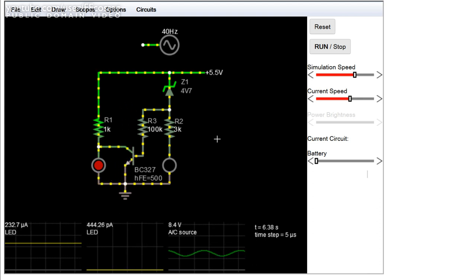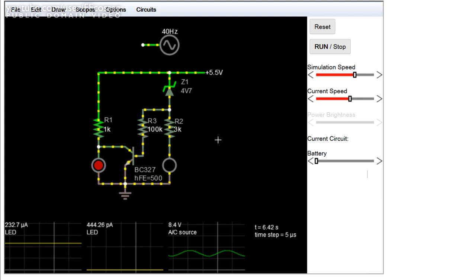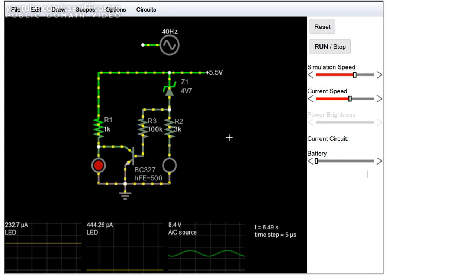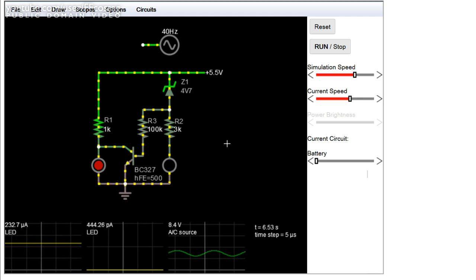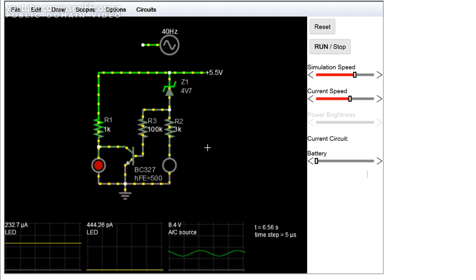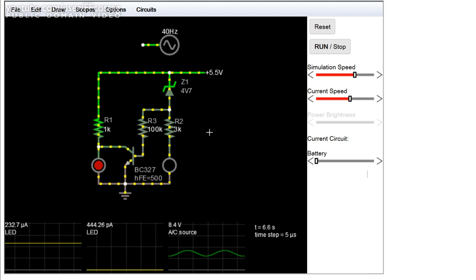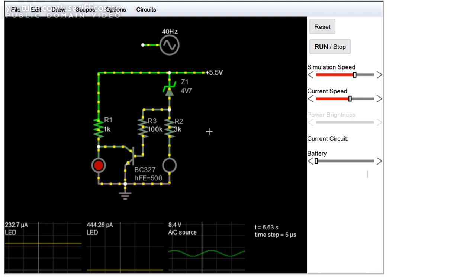And that's about it. Thank you for watching. I hope you found this bit of circuit trivia useful. I've provided links to the simulator as well as this circuit loaded into the simulator down below if you want to play around with it and make your own version. This can of course be applied to all kinds of voltages and all kinds of response ranges. By trimming the values of these three components, you can make this a 1 volt range, or you can make it a 100 volt range. It doesn't quite matter.